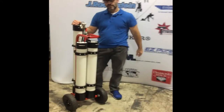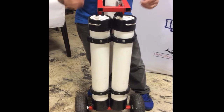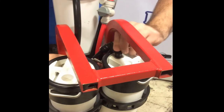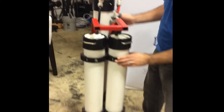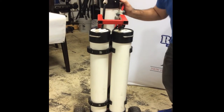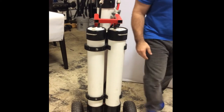Come on over and let's take a look. First thing you want to do when changing the filter is disconnect it from the machine. These are all push fittings, so that's your first step. Second would be loosen those clamps, the Cobra clamps from the housing.